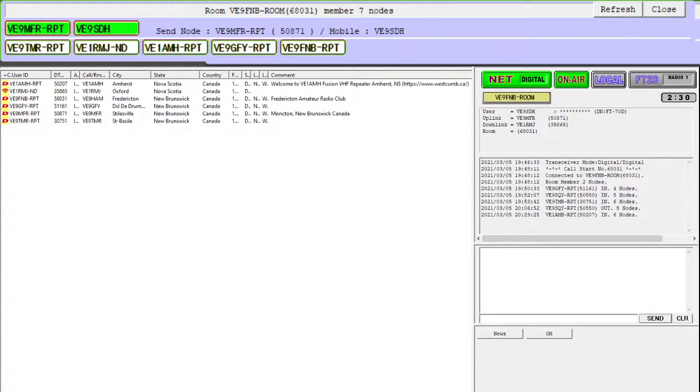When you ask what I like for antennas, tonight I'm using a dual-band Arrow J-pole in the attic of my garage, and everything that I have is pretty much stealthy. For HF I run a G5RV Junior, and I usually hang that out my clothesline. Believe it or not, that's a little less than 8 feet off the ground in places. But I've gotten into Russia, talked to South Africa, and heard Hawaii. So not too bad for a meager situation.